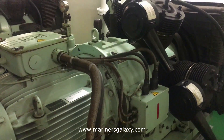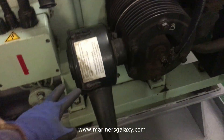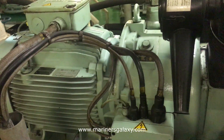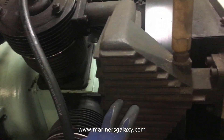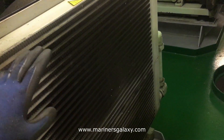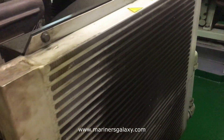We'll have a brief discussion about each part. Starting from the first stage — these two are the suction filters. This compressor has two first stages. These are the filters from where it will take the fresh air. When the compressor starts it will compress and put it into this manifold, which comes with a temperature gauge so you can see the temperature. There is an impeller attached to this motor itself, so it cools down the air.